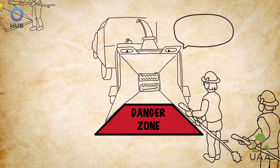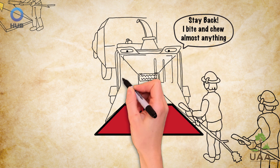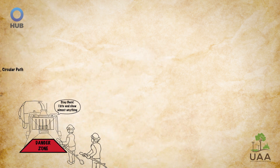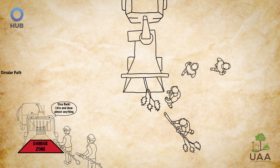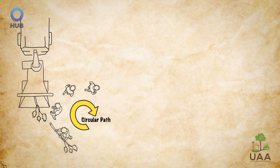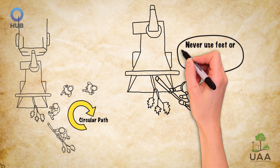Carmen and Alex keep their hands and other body parts away from all moving parts or pinch points of the machine, and never go beyond the chipper curtain or near its feed rollers. In this example, we see Alex feed brush, then continue moving forward and to the right, away from the chipper. Alex will use a push stick or larger branch to feed smaller pieces into the feed wheels.